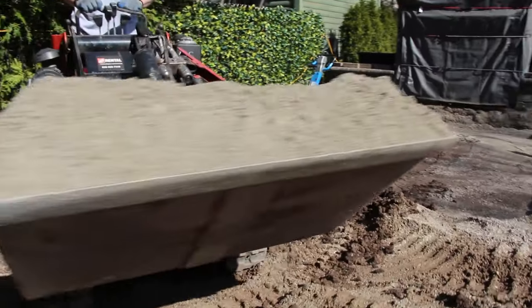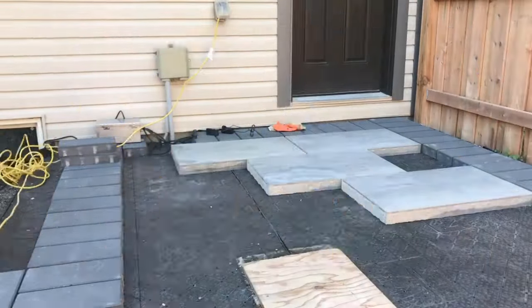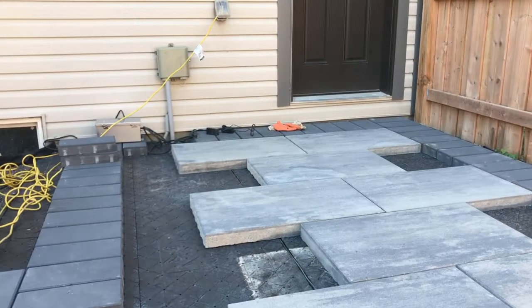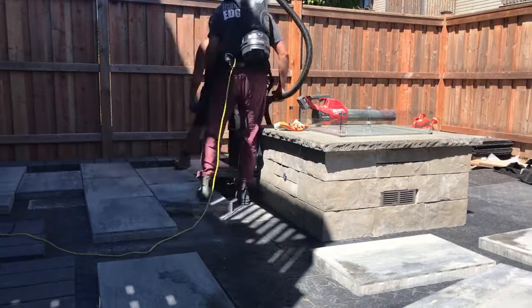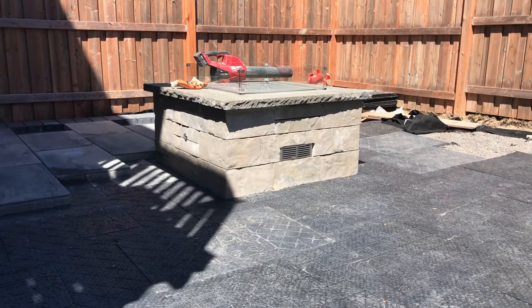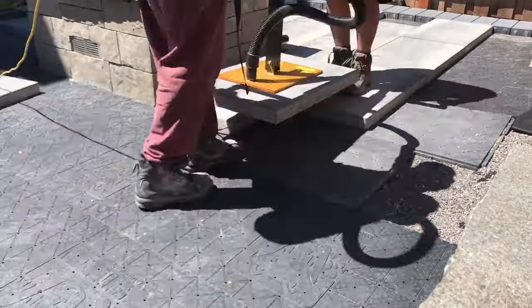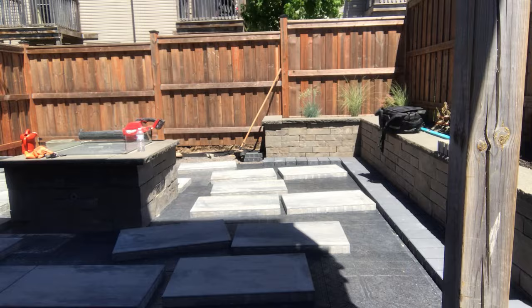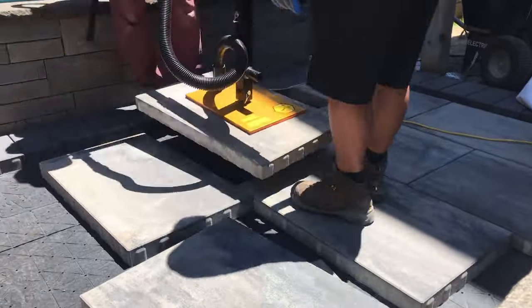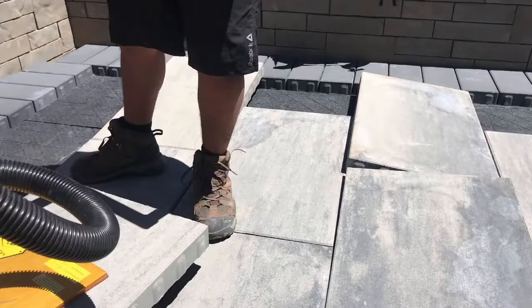So our excavation goes from at least ten inches all the way down to about four inches. Beyond just saving you in labor, synthetic base spreads the load of the patio over a wider area. It also insulates the ground below it so it's less susceptible to freeze-thaw cycles, which is perfect here in Toronto. In the laying process it's so much easier — you just screed out, lay your paver base panels, and then you can walk everywhere on those panels and stage pavers closer to where you'll be laying them. You can't do that with any other base because you'd ruin your screed layer.